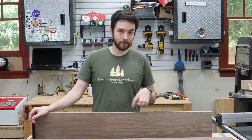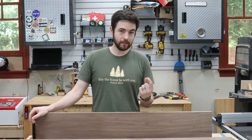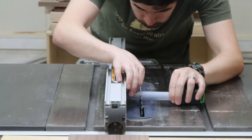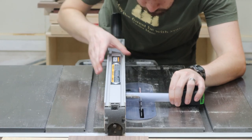The next step is to cut the milled boards down to thinner strips. We'll use this as hardwood edge banding to hide the plywood edge and give a more luxurious look. To do this, we carefully set up our fence and ran the boards through the table saw.